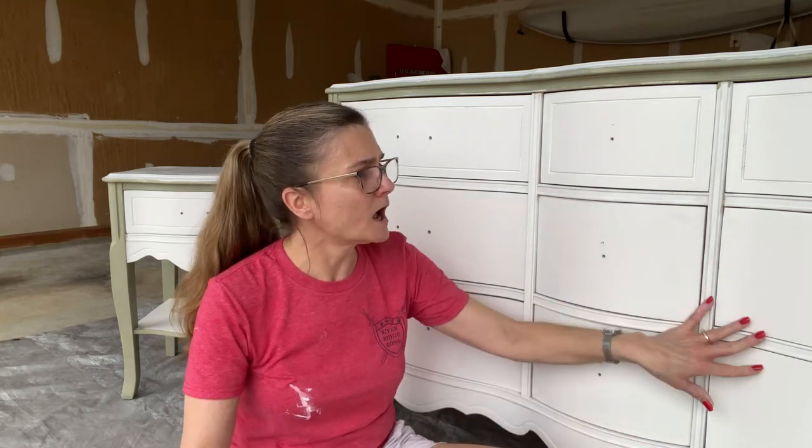I'm really glad I did that because in the natural light, I realized this still needed to be sanded some — there were spots that did not look good. Now I'm a perfectionist, but I am selling this. So I ended up sanding it again with 150 and then a very fine Surf Prep wrap pad. Then I wiped and vacuumed up all the dust, and we're ready to go.